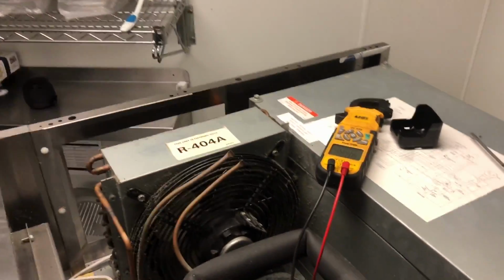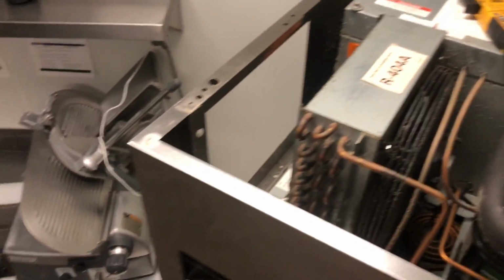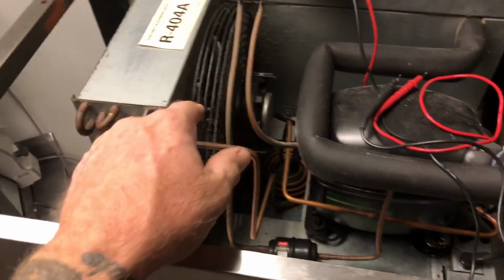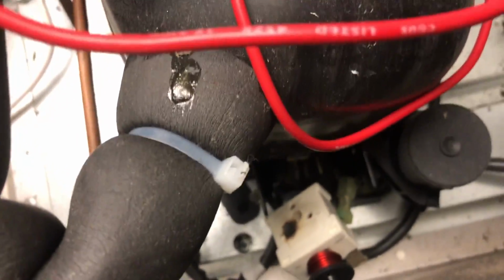Here's the most ultimate multiple offender. All right, so the thermostat's goofy. Stuck in defrost. I can get it out of defrost. Condenser fan runs, no compressor. If you look down there, the condensate loop has sprung a leak. See all the oil? And you can see the oil on the leg there and in the hole. So it's out of gas. Oil's everywhere. And then the compressor's,